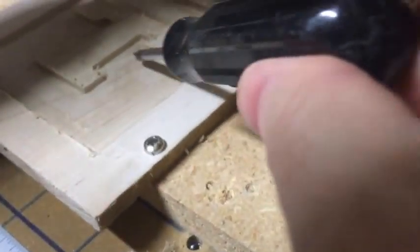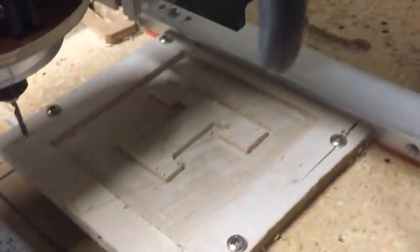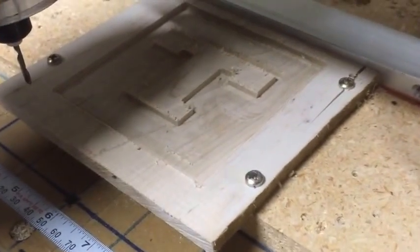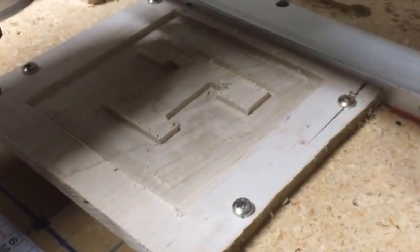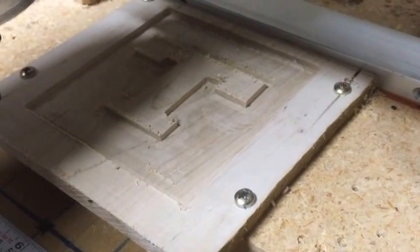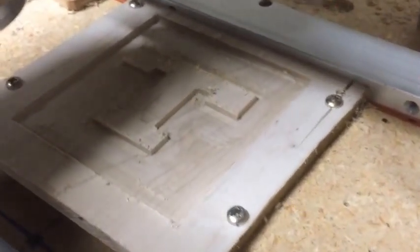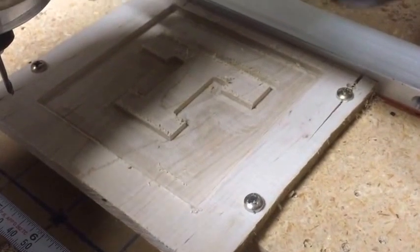All right James, it just came in and cleaned up right around the edges of the T, and cleaned around the edges of my box, and everything is still nice and smooth in there. The detail bit doesn't go any lower than the roughing bit went, because if it did that would just mess everything up. So you take this out, do a little sanding, and it's going to look exactly like it should. That's the two-stage cutting on Easel. If yours isn't coming out like that, either you're setting up something differently or the machine is having a problem in the Z-axis making it go lower than it should. I'll post this and you take a look and see if anything jumps out at you that you're doing differently.